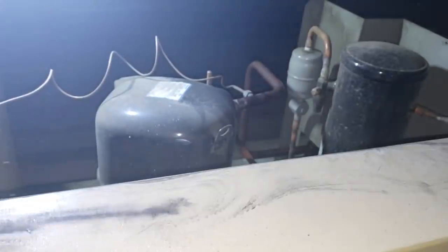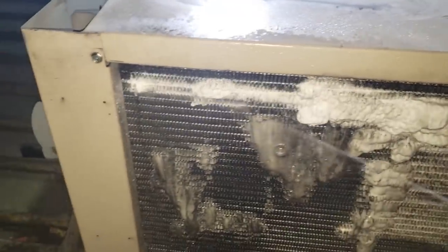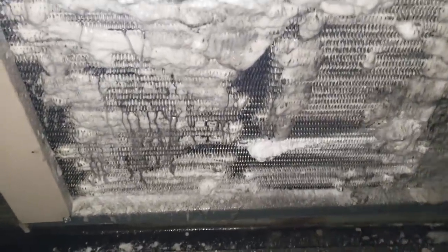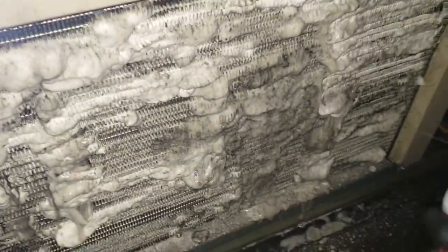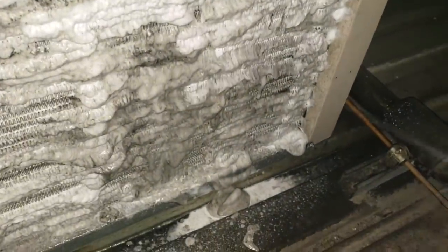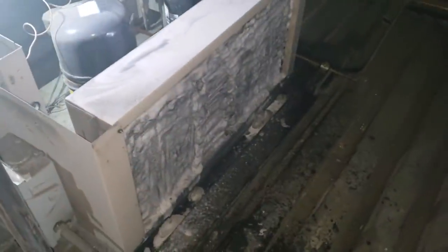Be careful — as I'm doing that, I can see it coming through the other side, so you don't want to get this foam in the windings of the motor. Even going the opposite direction, it's still pulling the dirt out — look at how dirty the brand-new foam is getting. This stuff works really well. An important personal preference: when you're done cleaning a micro-channel coil, take CO2 or nitrogen and push the moisture out, because it often gets stuck in the micro channels. We're foaming through nicely — technically this is a no-rinse product, but I'll let it sit and then rinse it off.